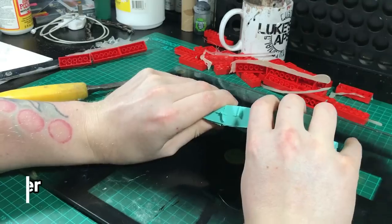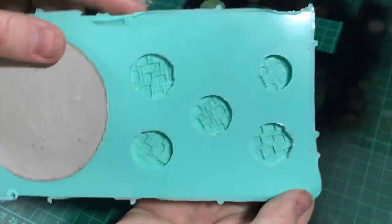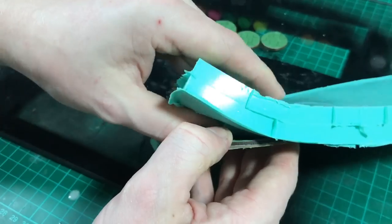I hope that's been helpful and answers questions on basic mould making. Next up will be casting and what resins to use. So you saw how simple that is — the hardest thing about mould making is getting it out of the box. If you can do that, you're going to master this. It's very simple. The only thing that worries people is getting the 5% catalyst ratio right. If you put too much in, it's only going to go off a bit quicker — it's not an exact science that doesn't work any other way.